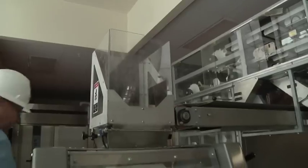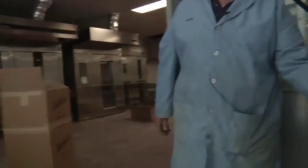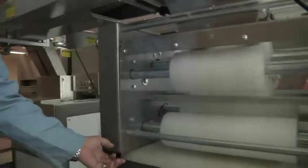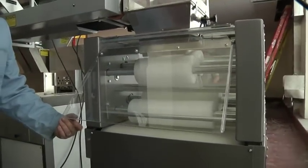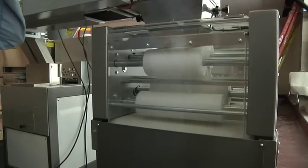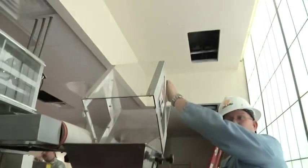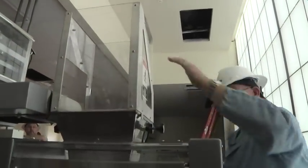There's also a back cover which, when lifted up, shuts off the molder. So you have three safety switches on here that all have to be okay before the machine will run. For example, if this cover is up, the machine cannot start — all the covers have to be closed to start the machine.